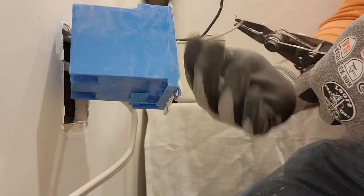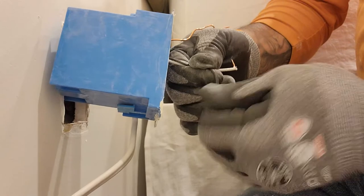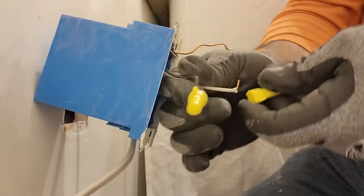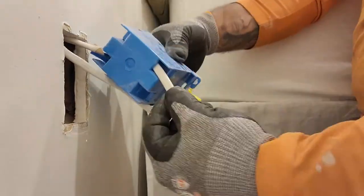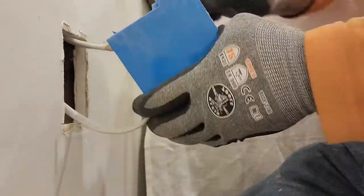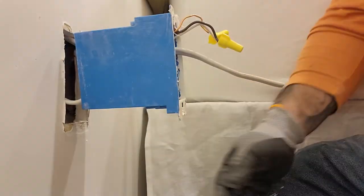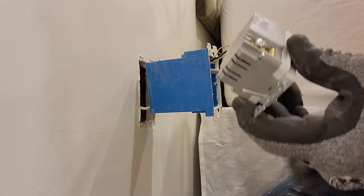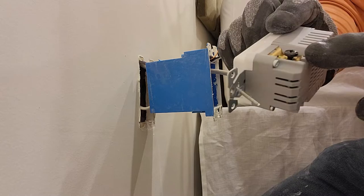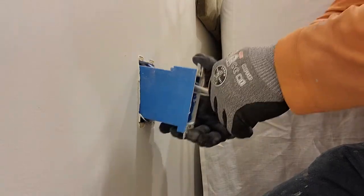See how that's not reliable — it just comes right out. So while I'm working on this, I'm going to put a cap on the hot wire so I don't get shocked. Now we've got our wires sorted. White goes with white, black goes with black. Sometimes they're labeled brass — brass goes with the black. White to white, black to black.